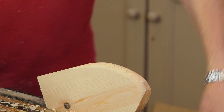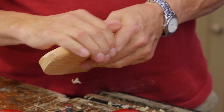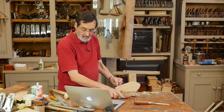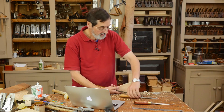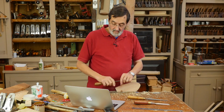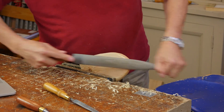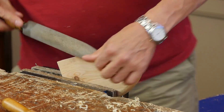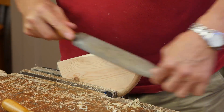So that's one great way to work with that — you can see this nice shape. Now you scrape it, sand it, whatever you want to do, get it super smooth. Here's another way that I think is great: you could use tools called rasps. They're quite expensive — this one will cost you around 15 pounds or 20 dollars — but you can get inexpensive ones. This one is basically taking the 45-degree corner off very rapidly.